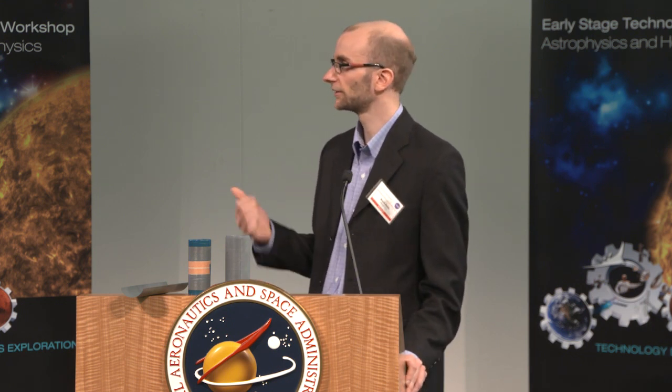So we've actually taken a lot of time just trying to specifically characterize how this thing's going to look in the undeployed state. Let's see here. Oh, a little bit of delay there. Got it. All right. So as I mentioned before, the accurate modeling is critical. In addition, one of the reasons is we're trying to model the strain energy of the system, and it's a strain energy that deploys the petal. So it's really important to make sure that, A, we have enough stored strain energy in the system to deploy the system, but we don't want excess strain energy, because then it's going to be harder to control that as the events occur.